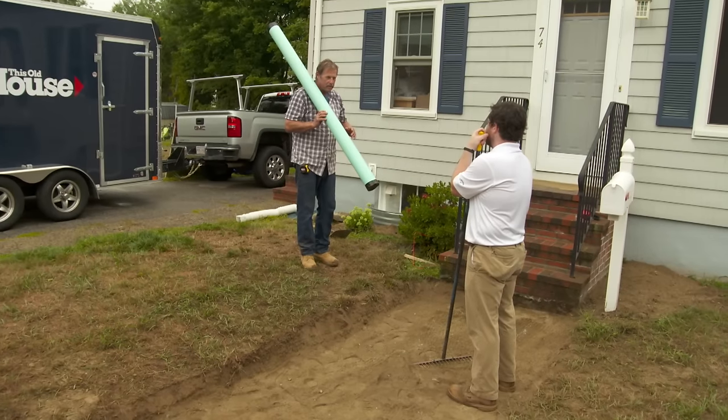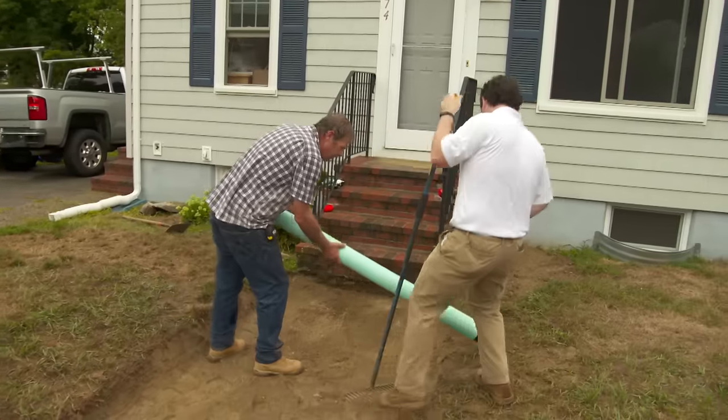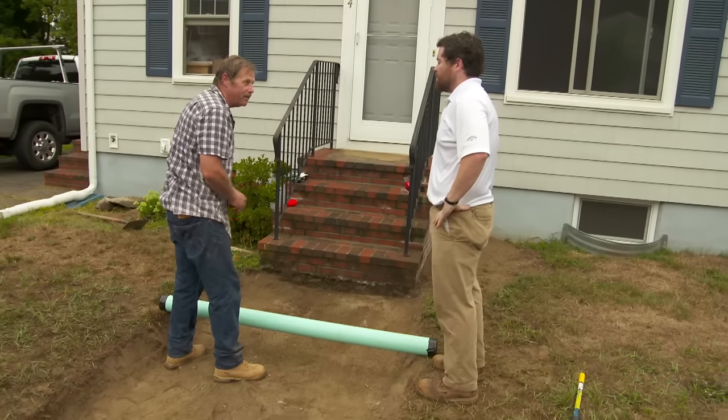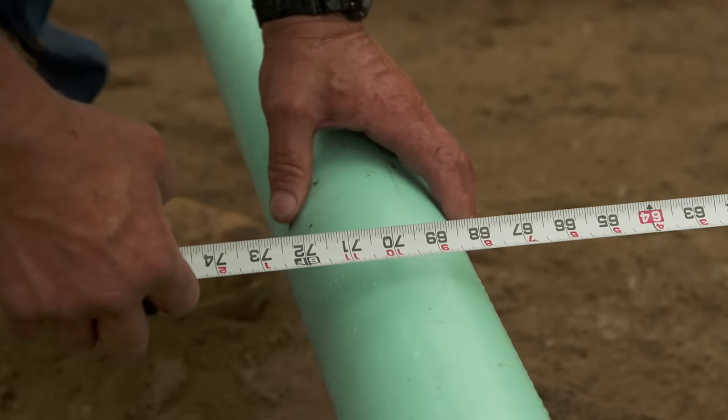I have a question for you — how tall are you? 5'10". Let me show you a trick. What really happens is people forget to put in a way to get an electric line or an irrigation line through the yard under a brand new walk, and they have to dig up the whole walk. So we're going to come out 5'10" and install a sleeve underneath the walk at that measurement — you'll never forget it. If anyone wants to run irrigation or electric and has to go under your new walk, no problem. Let's dig out a foot on each side and bury it in the ground.